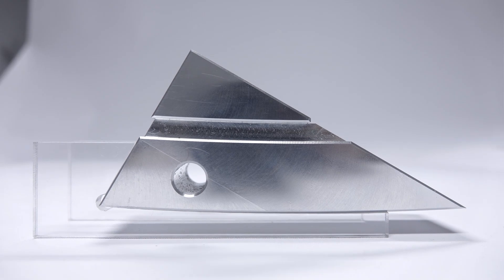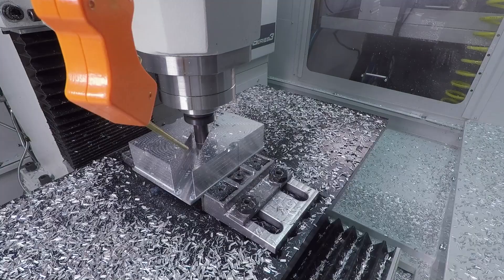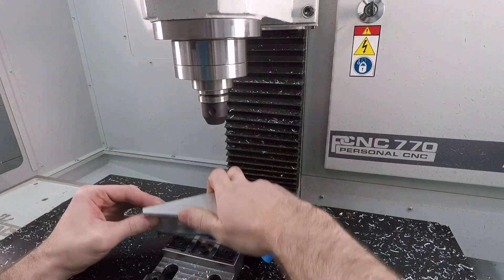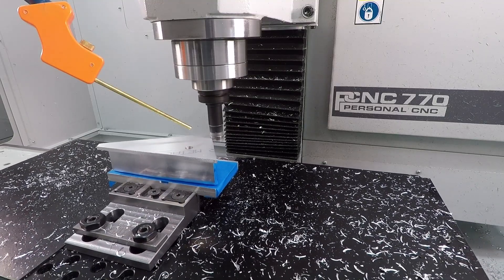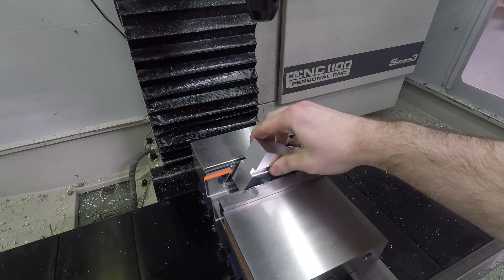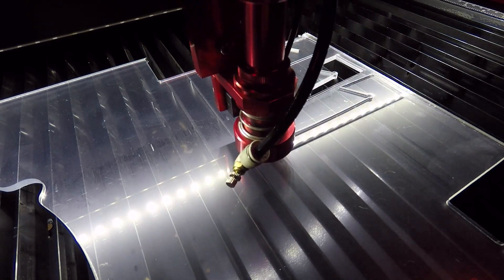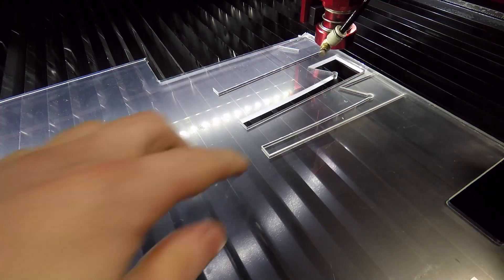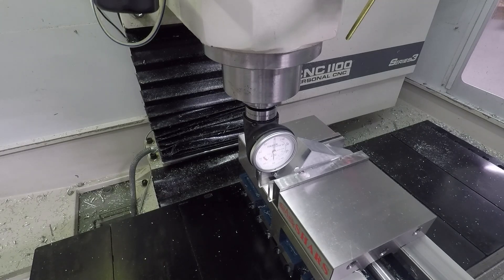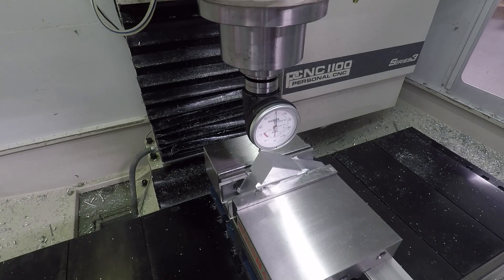Next up, Widget 190. We had to machine a part and used a laser-cut jig for the final operation. We started by holding the material in a Saunders MachineWorks mod vise. In Op 2 we used the super glue technique to deck off the top hat. For Op 3 we needed to hold the part at a specific angle, which was difficult because the bottom of the part is curved. We laser-cut a jig — you could also machine it or 3D print it — which let us hold that final operation in a traditional hard-jaw CNC vise, handling the angled floor and giving us a work datum to pick up off of.